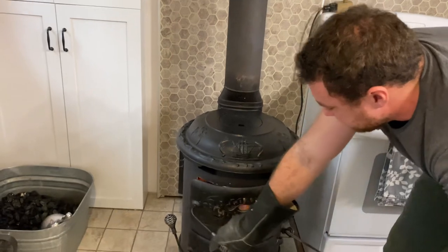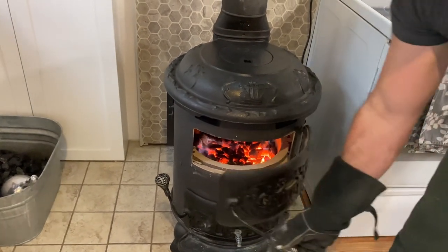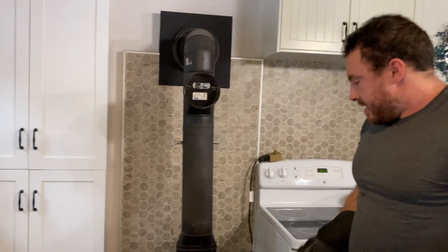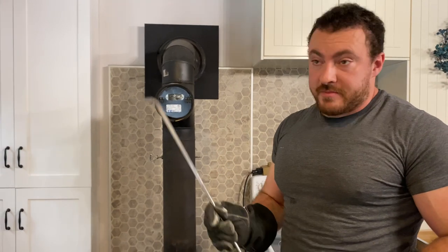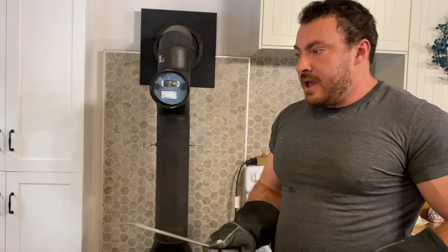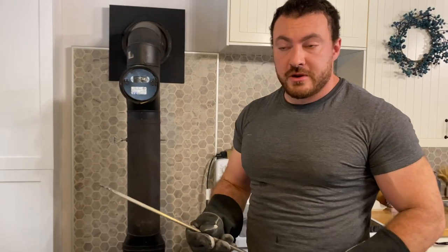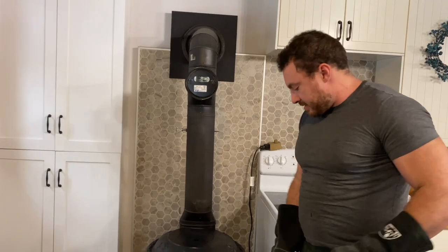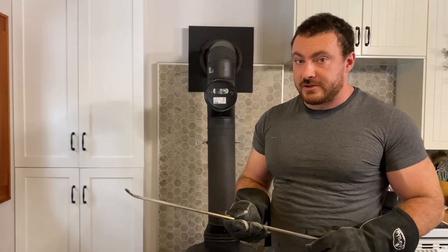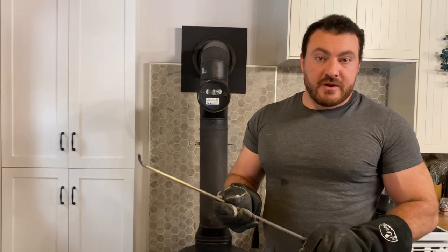I'll show you how this looks in real time. That was a lot less than 27 — I didn't keep count. That reduces the difficulty of servicing even more. Whereas my previous video showed the lying-down method with flossing each slot individually and then the full 27 shakes, with this method you just stoop down, slide the poker through the doors, and get by with only 10 or 15 shakes. So it reduces what's already a light and easy job of about five minutes every 12 hours to possibly as little as three minutes — a lot less time and energy than keeping a wood stove going.